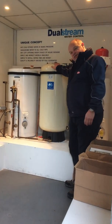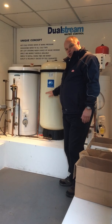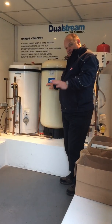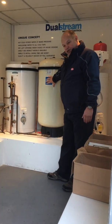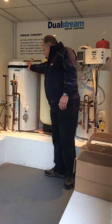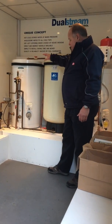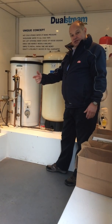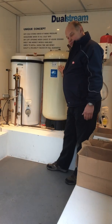This tank is sitting here at the moment with about 4 bar of mains pressure water in it, waiting for demand from the property to come on, and then the flow is delivered from the accumulator. This accumulator is linked up into this unvented hot water cylinder and will provide flow through the hot water cylinder and through the cold feed pipes to deliver a balanced flow into the property.